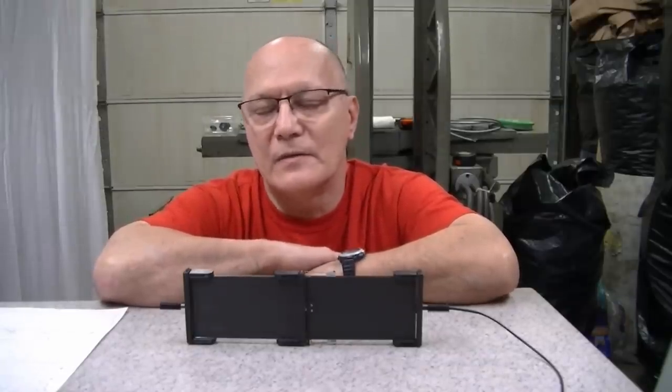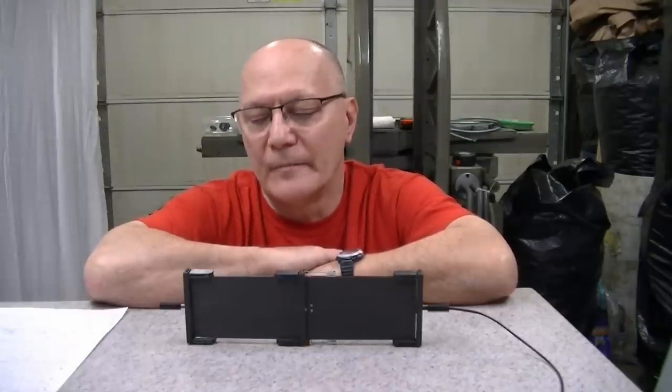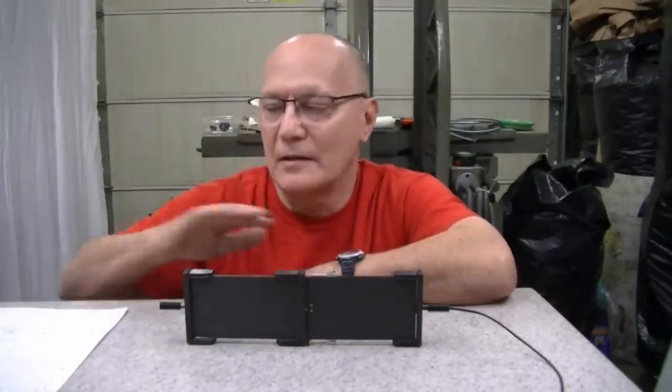That's why this is eight inches thick — if it were black granite it would be thinner. It's also why you can't just take a B-grade plate and have it lapped to AA. Yes, it may measure AA, but it doesn't actually follow the AA guidelines because it's going to deform out of tolerance with the 50 pounds per square foot rating. If you had bought that plate originally as AA, it would be much thicker. There's also a 100 pounds per square foot rating requiring even thicker material — it's simply a beam calculation.